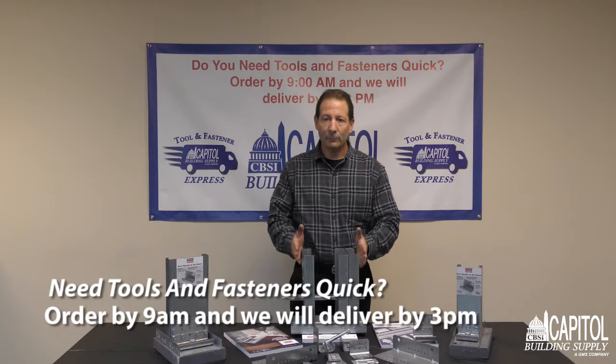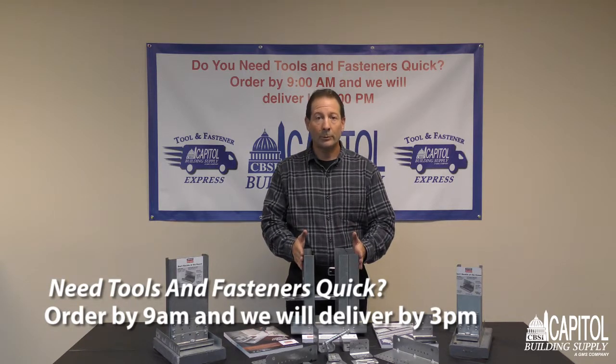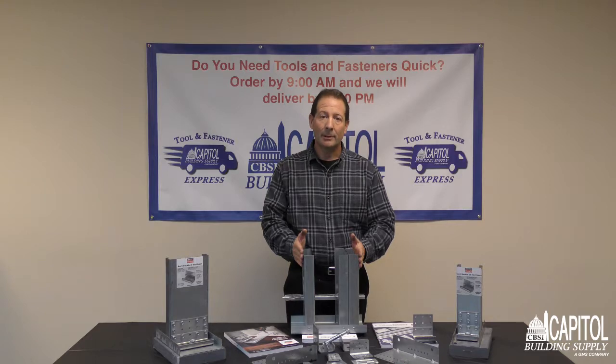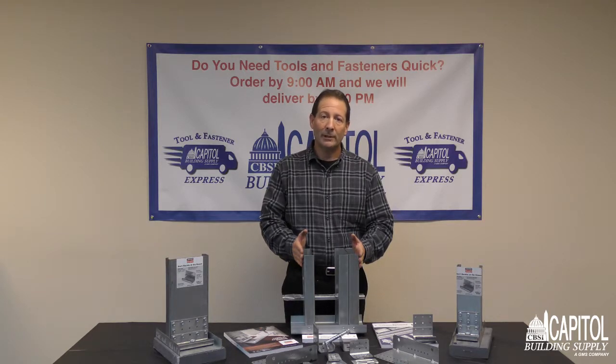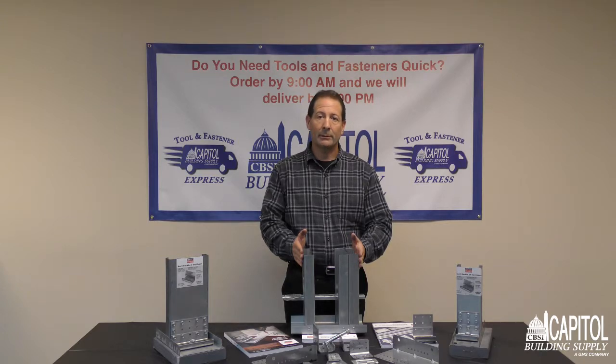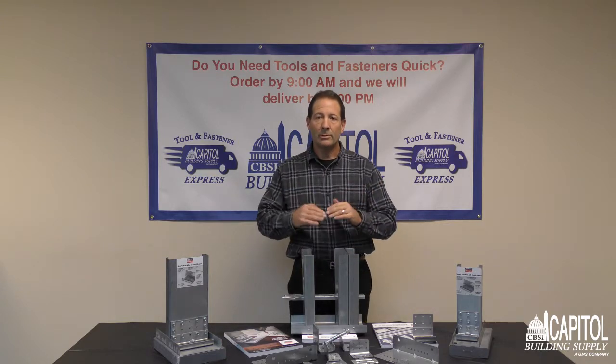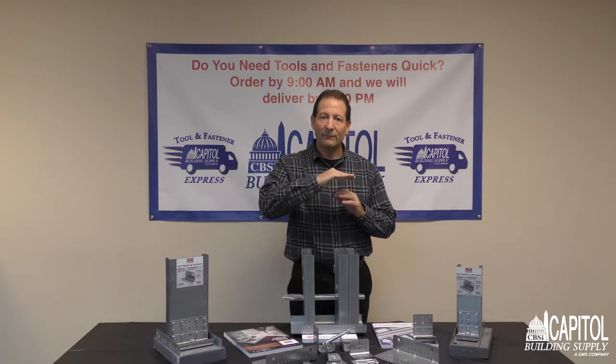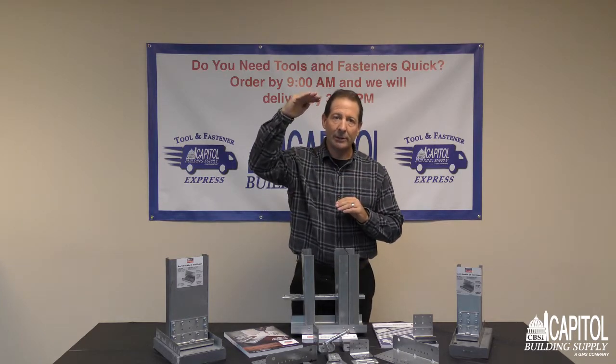There's a couple of different ways. Typically we are going to have 16 gauge studs, but they could be anywhere from 16, 14, and 12 gauge studs on the exterior of the building. You're going to have your studs. You need to bridge that typically every 4 feet to 6 feet going up.